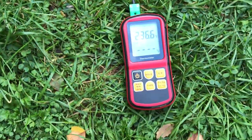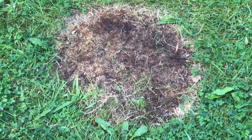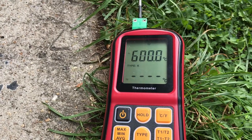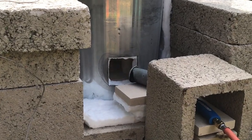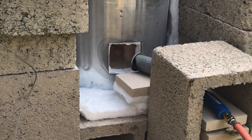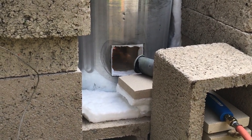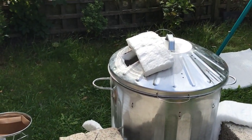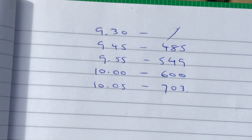The temperature is climbing quite slowly but it is climbing. I also put a piece of ceramic fibre down on the garden — I mentioned earlier that I managed to burn a hole in the lawn on a previous firing, so now I just put a piece of ceramic fibre down and then put the lid directly on that. Once it reached 600 degrees centigrade I decided to ramp up the temperature increase more quickly, so I increased the fuel. You can probably see a bit of heat haze coming out of the top, and I jotted down a few notes about how long it had taken to reach certain temperatures.